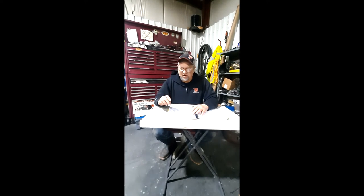Well, that makes sense. If you don't grease it, it's going to tear it up. During the first week of operation or after replacement of the accumulator diaphragm, the charge pressure must be checked daily. Once there is evidence that the charge is holding, they must be checked weekly. So, we're going to go over diaphragms in another video, but that is one of the differences between the rotary drills and the percussion drills.